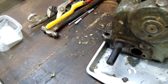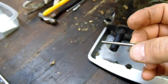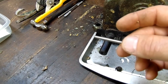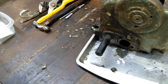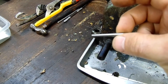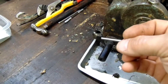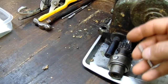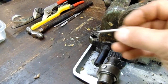I want to show you a common problem. This thing is put on a taper pin. If you've rebuilt machinery or worked on older stuff or if you're a machinist, you're acquainted with these taper pins. You're also probably acquainted with what people do with these taper pins because they don't understand them, and that's what had happened here. A taper pin is exactly what it's called — it tapers, bigger on one end, smaller on another, and it's driven in a tapered hole, which means it's got to be driven out a certain way. Somebody had tried to take this off and drive the pin out the wrong way.